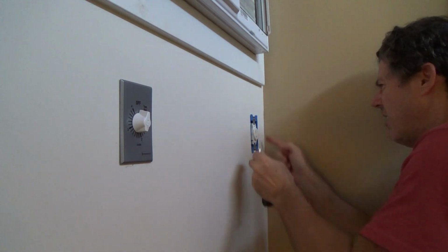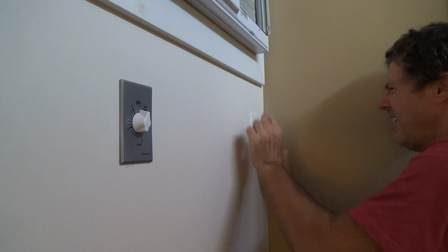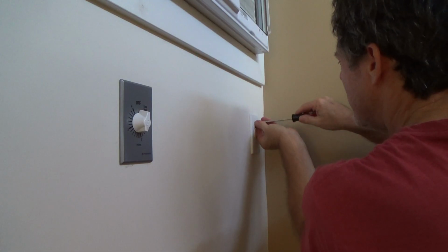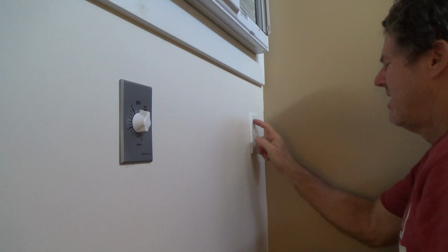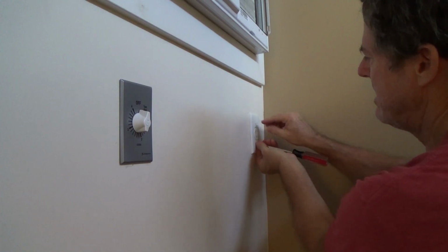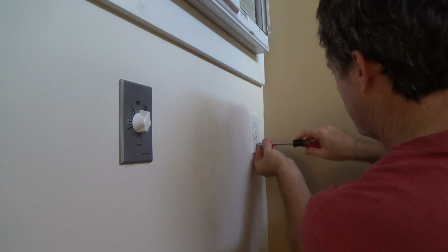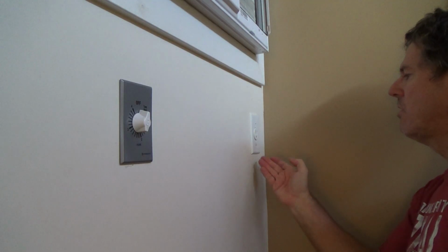In this case, I've got a cover plate to deal with too. I want to make sure I cover everything of what was existing so I can hold this on there. And it looks like it's fine. Okay. Get my other screwdriver out here and put this in. And all I want to do on this cover is make it snug. Depending what kind of cover it is. If you have a vinyl one, you can tighten it up a little bit more, but I don't even like tightening those up too much because then it dimples. It'll dimple this in, and in the light you might be able to see it. And so I still try to make it snug. This one is kind of a hard plastic type cover plate. Not plastic, well, it's kind of plastic, I guess, but it doesn't give. If you tighten it too much, you can crack this.